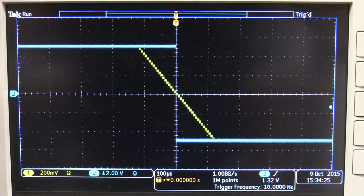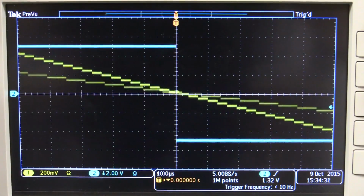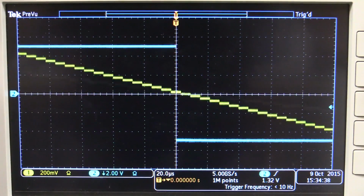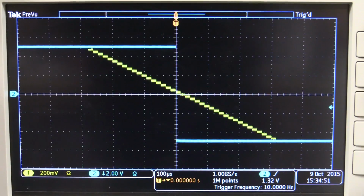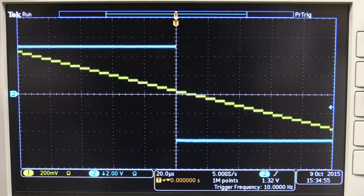look at the yellow waveform there, that is the Rigol. Look at that. You can see the individual steps there. But look, zoom all the way in, and there's the blue one, of course, is our Siglent. Absolutely perfect. It's a Bobby Dazzler. Look at that. But look at the horrible, well, in this case, fall time. It'll be the same for the rise time on the Rigol. It's absolutely atrocious. So that's the difference between the DDS output. You can actually see the individual samples there.